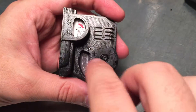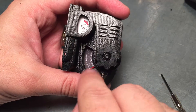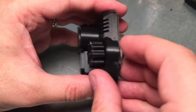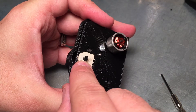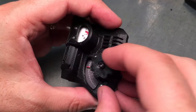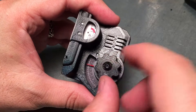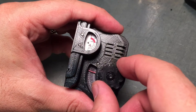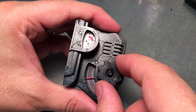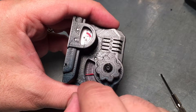What I wanted to do with this version was have the needle readout in its position be directly read by the potentiometer — no slop due to gearing. Previously I had the potentiometer connected directly to the knob, and if any gear slipped or even bounced back and forth, the readout may not be accurate.